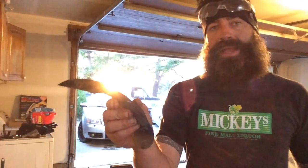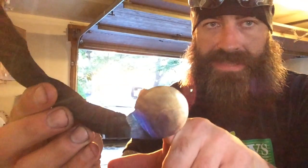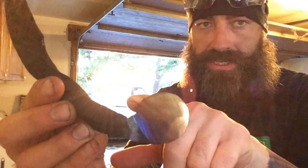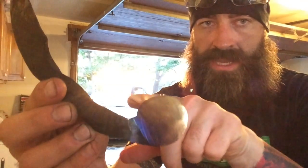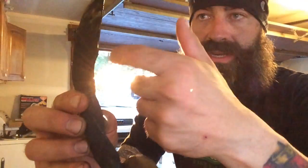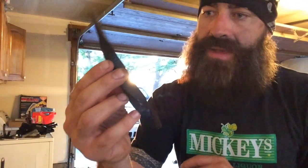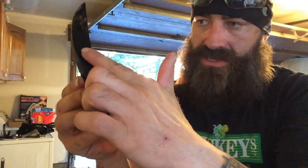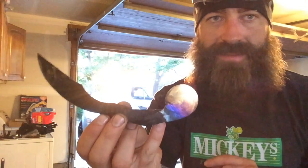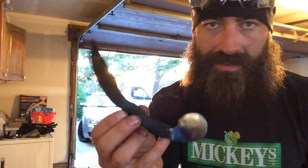Now I'm all hardened on the blade. One of the last things that I'm going to do, I almost forgot. I couldn't get the edge of my belt sander into this little nook between the handle and the ring hole, so I'm going to hit that with the angle grinder real quick, and then I'm going to start working down the blade on either side. I'll also probably sit in my bed because it's getting kind of late and start polishing the handle and everything else with a fine grit sandpaper, getting ready to drill this out and edge the blade.